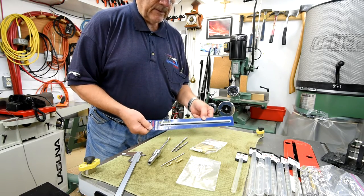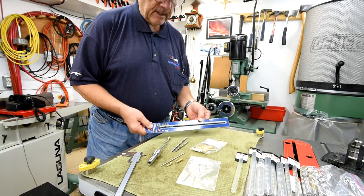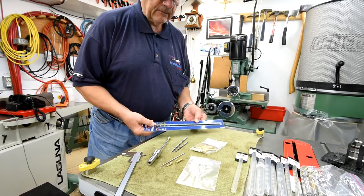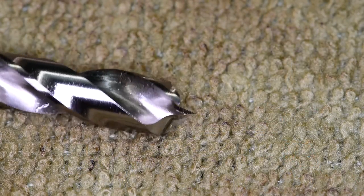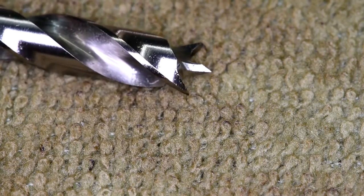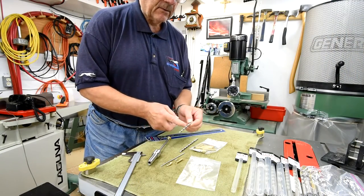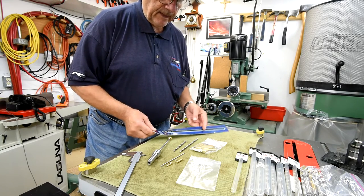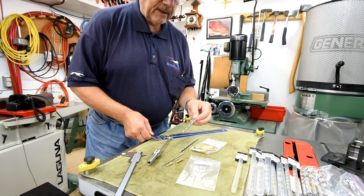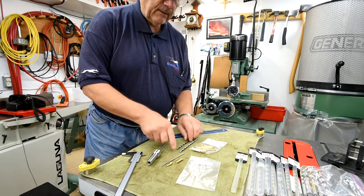Second thing is, I went out this morning and I bought a longer quarter inch bit. Now this isn't exactly the kind I wanted, but this is all I could find. I had wanted one with a brad point like this. Anyway, what I'm going to do is I'll use this quarter inch bit to go most of the way into the work, and then I'll finish off with this longer one. I think that this bit will probably have a tendency to drill a lot more true. Anyway, that's my opinion.